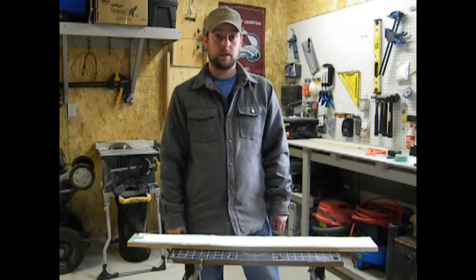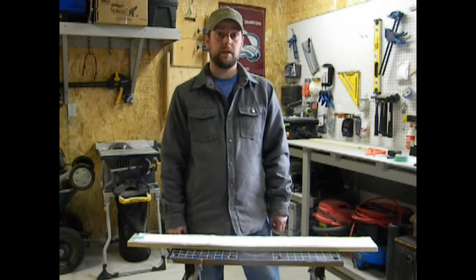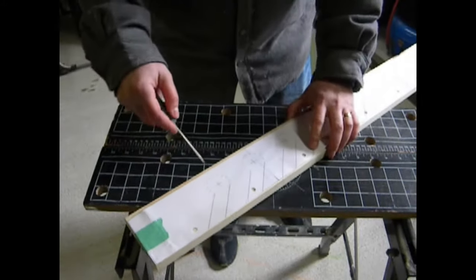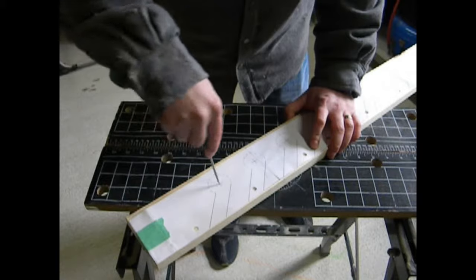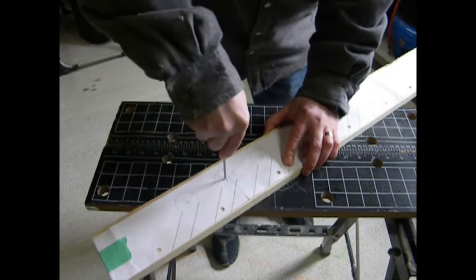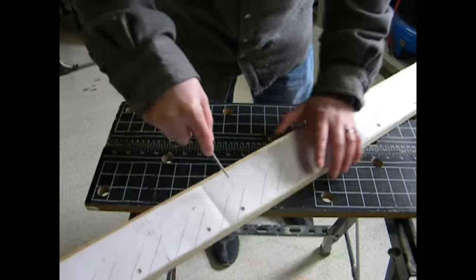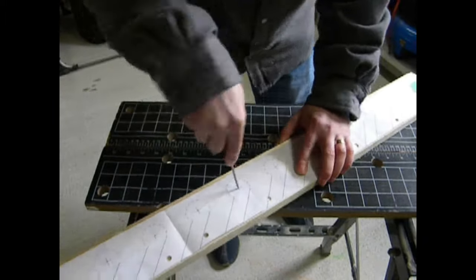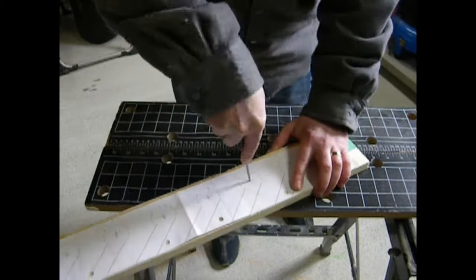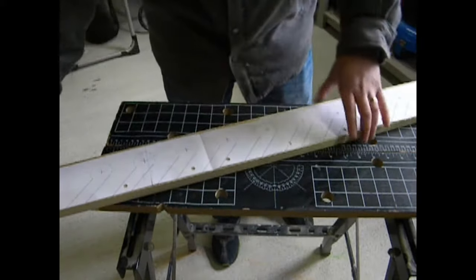Now that we have our boards marked out to the length that you want, we're going to mark out the holes. I have a template for this in the description below. So we're just going to put a little mark in the center of each hole so we know where to drill each hole with the drill press. Now we've got to do the same thing with the second board.